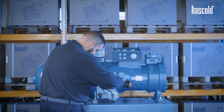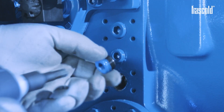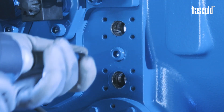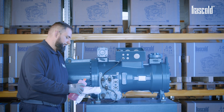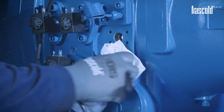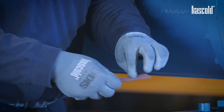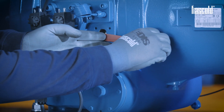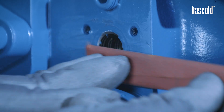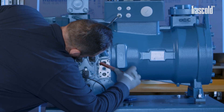Take a screw gun or ratchet with a 3/8 inch socket and remove the two caps at both ends in the area where the flow switch is to be installed. Before proceeding, remove any oily residues from the surface, then remove all paint around the holes using a file with sandpaper or a sander. Take care not to get any paint residues inside the compressor, as this is essential to ensure an excellent seal of the gaskets.